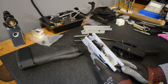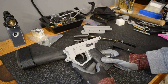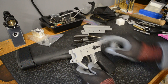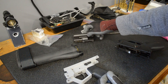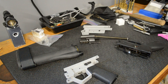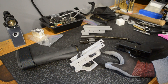That will probably be my next update for this video series, and hopefully I'll have a really cool test fire video. If you have ideas on how I can make this work, let me know. And if you know about the hammer — whether it's safe to put a flat hammer in place of where this curved one is — I just don't want any abnormal wear on the back of the bolt. I know 9mm ARs have a problem with those and they talk about using a ramped bolt, which is preferable. That's it for this video — next time I'll hopefully have a more exciting one with lots of test fire.